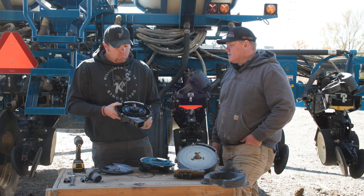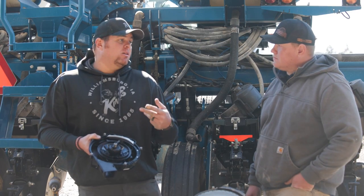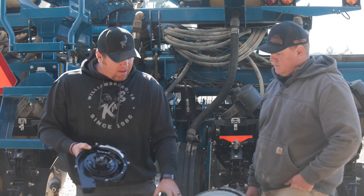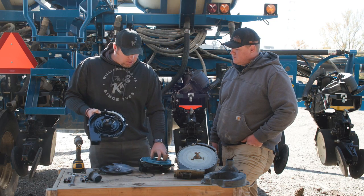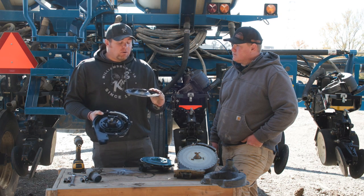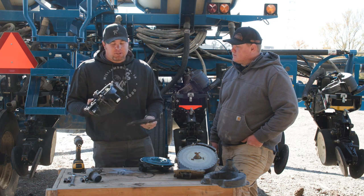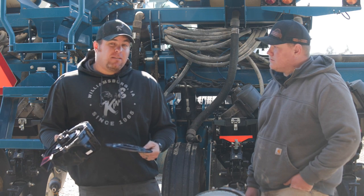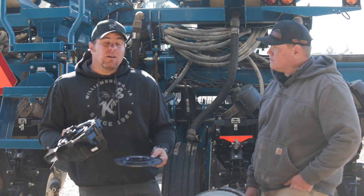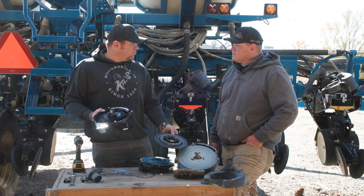Other than corn and soybeans, what crops does this support? Very similar to the edge vac: cotton, sugar beets, milo. There's a cover crop wheat disc that a lot of guys use. For corn, there's just one corn disc for all corn. The soybean disc is a 120-cell disc for 30-inch row planters. On a split-row machine it would be a 60-cell disc, just like before. So there are a lot of crop options — it's a direct replacement in the market if you have an edge vac and are planting alternative crops like corn, soybeans, milo, and there's a wheat disc as well.